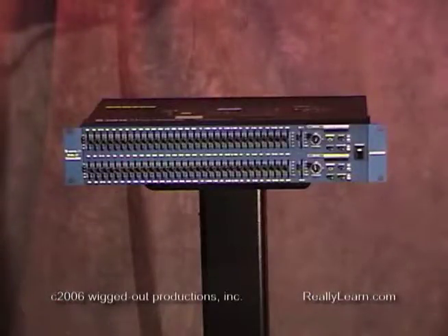Sometimes it's hard to avoid where mics are pointed, so we need another solution to the feedback problem. One popular way is to use a 31-band graphic equalizer for each power amp input. Those three or four control EQs on channel strips are referred to as parametric equalizers because they have a single control that sweeps across a frequency range until you find the best setting. To control feedback, we don't necessarily want to change the overall sound. Feedback is caused by a very narrow frequency range going crazy, so we only want to eliminate the offending frequency that's feeding back. The 31-band EQ allows us to do just that — the entire frequency range for the signal is cut up into 31 distinct slices, and each control manages just a very narrow frequency range. Once the narrow slice that's feeding back is located, you can turn it down or just turn it off completely.